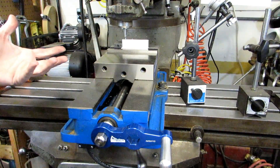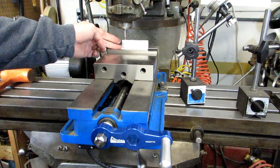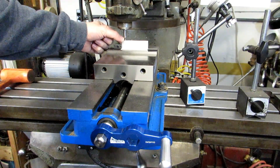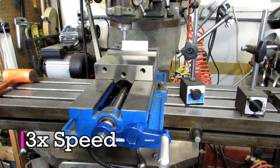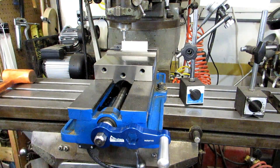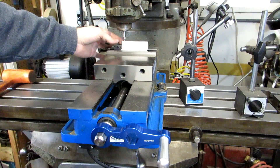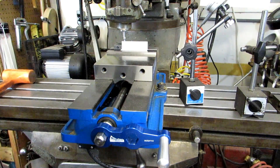I'm set up to find my edges. I've got my part bumped up against the vise stop so I won't have to find this edge multiple times. I'm going to use the fixed jaw side of my vise to find the Y-axis, which is what you should be doing anyway because that jaw doesn't move. There's my kickoff — the dials on a Bridgeport are 200 thousandths per revolution. Remember you've got to compensate for half the diameter of the tip on the edge finder, which is 100 thousandths. So I'm going to set my dial to 100 thousandths so when I move in my 100 for half the diameter of the tip, I'm on zero.